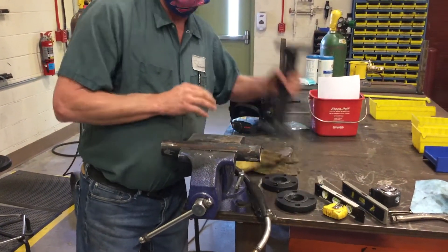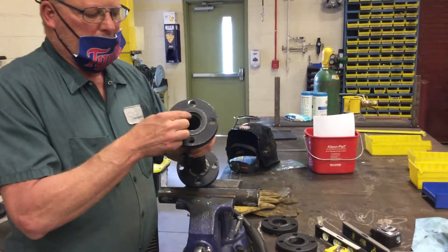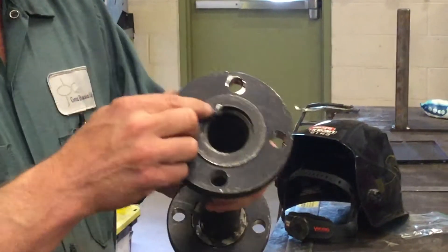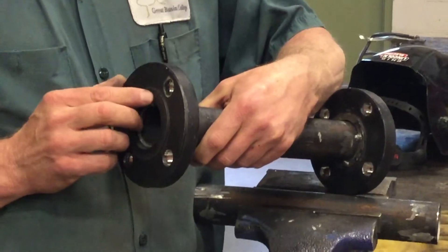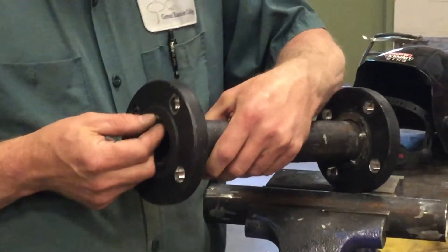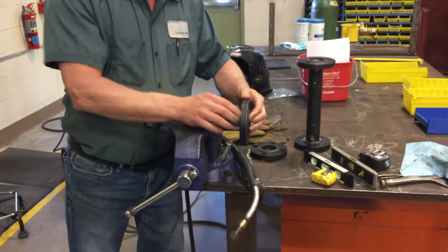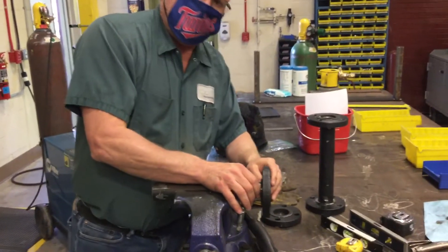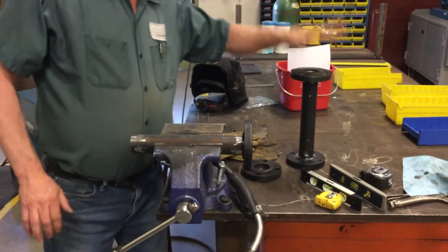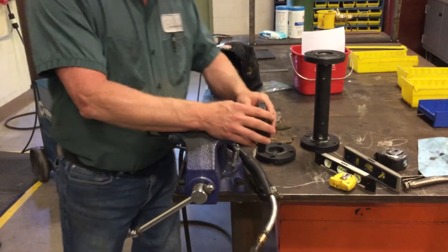Here's another example with spool pieces: if you look at the end of this one, when somebody tacked it they got the weld out on the face of the flange — you aren't going to get that to seal. So that's not how we do it. All the tacking we're going to do is on the outside of the pipe and the outside of the flange. When you make one of these for real out in the field you'll weld it 100 percent inside and outside, but for our examples down here we're going to break them apart and reuse the pieces.